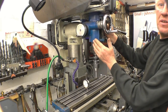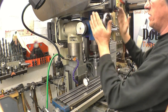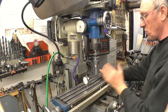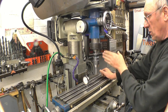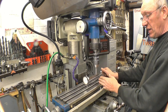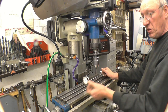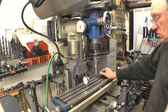The head on this milling machine is able to pivot - you can tilt it that way, which is good for drilling angled holes. I'm going to use a fly cutter in the milling machine, and when you use a fly cutter it's important that the spindle of the machine is perfectly at 90 degrees to the bed of the machine. That's called tramming the milling machine - when you hear the phrase 'the milling machine needs tramming,' that's what I'm talking about.